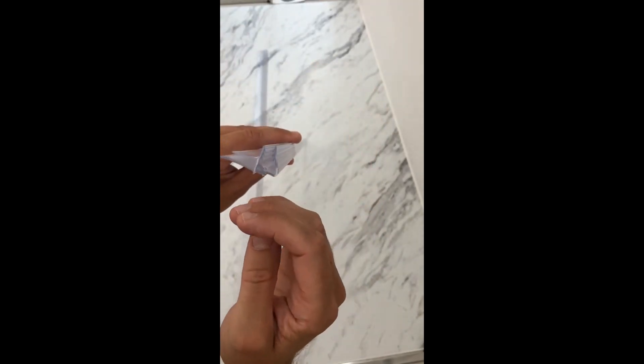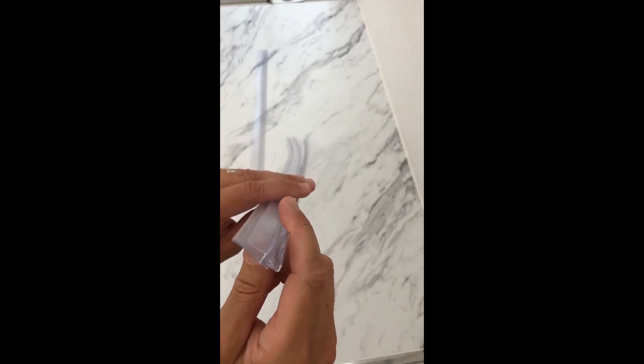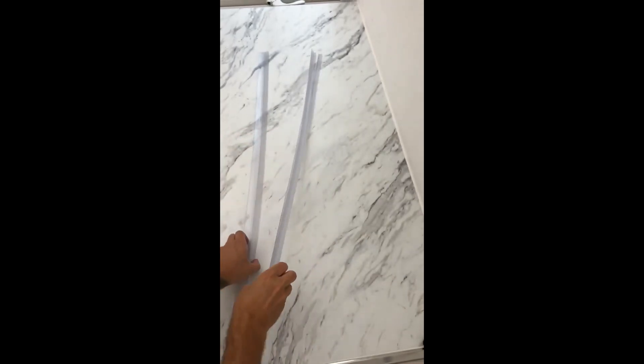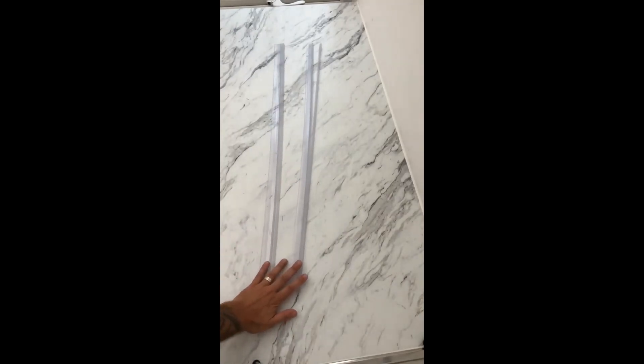The fins deflect water as it comes down the glass away from the gap between the glass and the metal frame underneath. The Uniblade will fit onto glass from 3mm to 8mm thick, straight or curved, because it is super flexible — probably the most flexible seal on the market. Hopefully this short video has answered your questions. If you have any more, please drop us a line, and we'll put the link to the longer detailed video in the description.